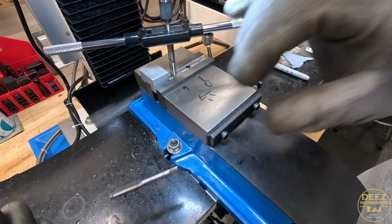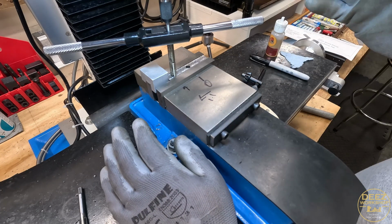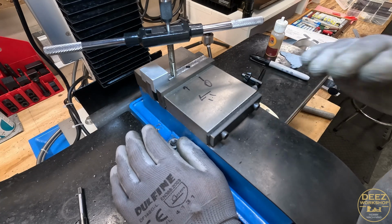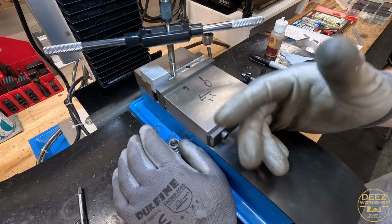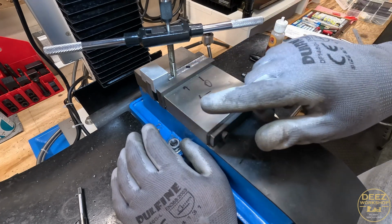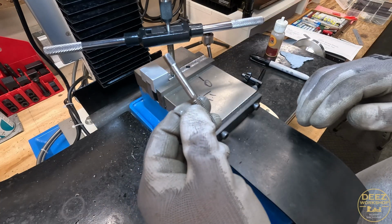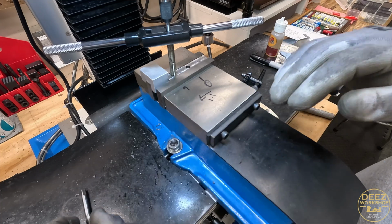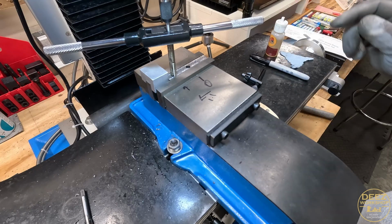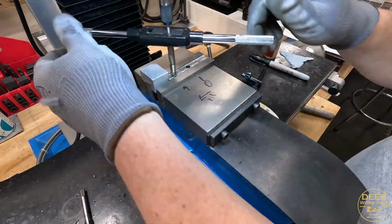It's really close to time to just trash all those, just to avoid the temptation of using them. Now that I have a decent set of other taps, I might just do that, but it's difficult to find a tap-only set. I don't need dies. So that's why I haven't thrown them away yet, but I just wanted to comment on that. This tap here is cutting. It's doing what it's supposed to do. There's just no comparison to what this one's doing. Be careful when you're working with these things. If you feel that thing flexing or moving, just back off and regroup, because you're going to snap a tap. Good luck getting that thing out. I haven't had much luck.